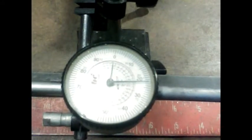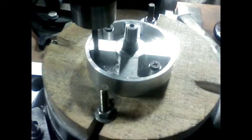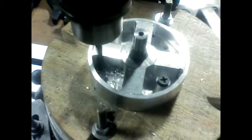Okay, I have my bit now touching the rim here. I'm clearing here properly. I need to move this on the x-axis now, 123 thousandths. There's the 123, lock the x-axis. That puts my bit right here now. Now I'm ready to drill down through here. And let's do that. Yeah, and these are reference holes to do my milling with.